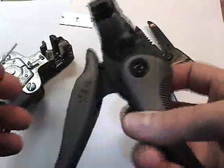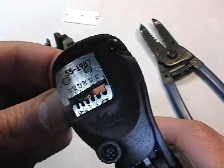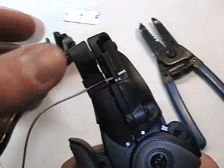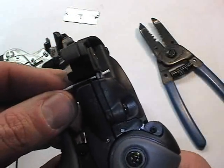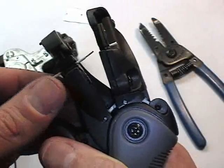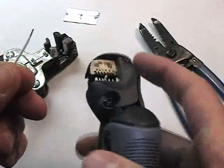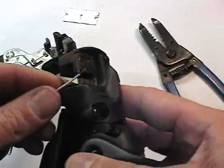Both of these tools work in the same fashion. I'll illustrate the nicer tool. We put the wire in — notice I'm putting it into the die for 22-gauge wire. As you squeeze, the left side of the tool grips the conductor with a really nice gripping surface that doesn't damage the insulation, while the right half brings the blades down in a guillotine fashion. We keep squeezing and it pulls the insulation away. You'll hear a click, and as you let go slightly, it releases the wire and holds the jaw open while you move it out of the way, then snaps shut ready for another cycle — often flinging the insulation out of the way.